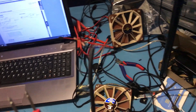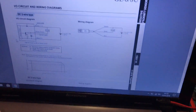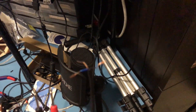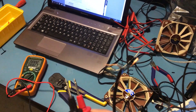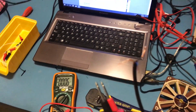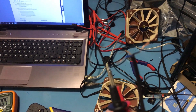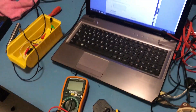Welcome to part 26 of my Black Damos videos. I've just stripped the wire from the end stop from the Duet Wi-Fi to do a simple check. According to the documentation, there should be 24 volts between the brown and the blue wire, since my setup is 24 volts. But when I measure these, I see like 15 millivolts, so there's definitely something weird going on.